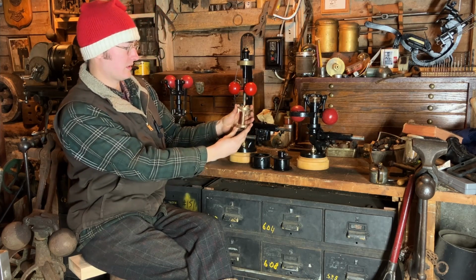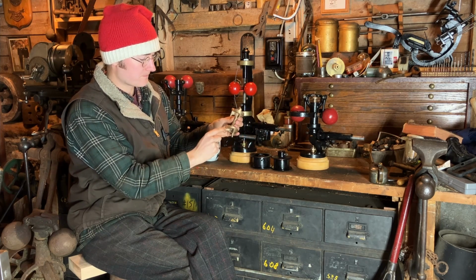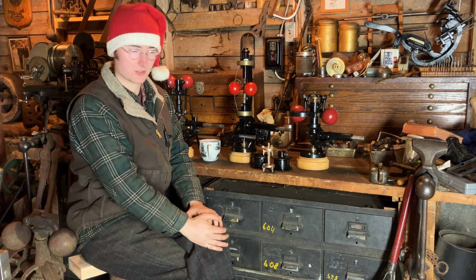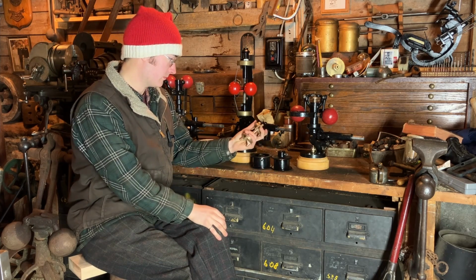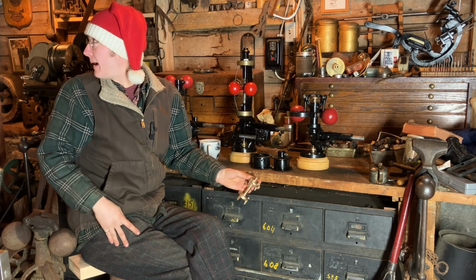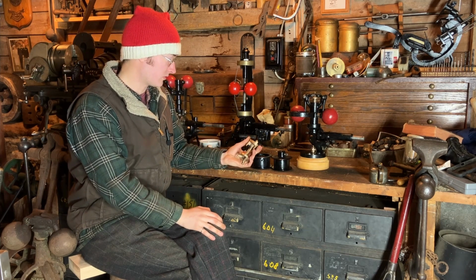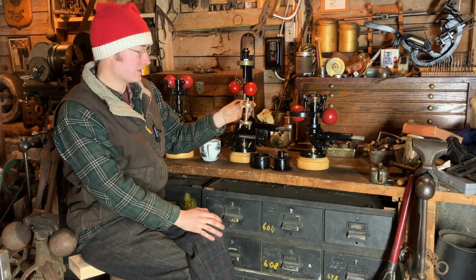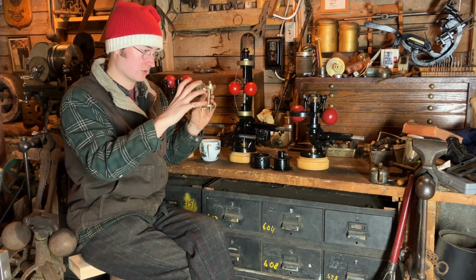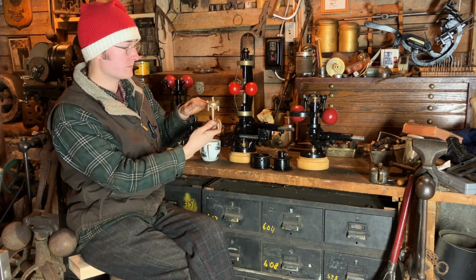So if you look closely, the valve has these tapers. That is to reduce the likelihood of the engine fluttering or shuddering. Fluttering is caused by kind of an open loop system. Your engine, your valve is at the top. You open your shutoff. Steam comes in, goes into the engine. Engine speeds up. Now the flyballs come out and close the valve.